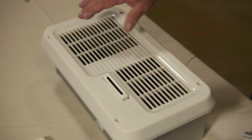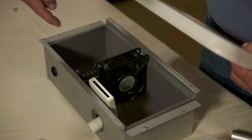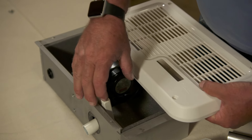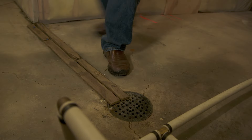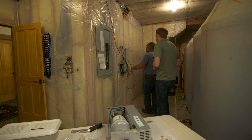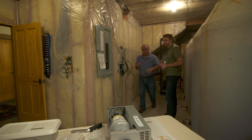The second component is this fan box. The hose sends steam in here, steam comes out here, and there's a little fan that draws air in from the room, across the steam, and back out to deliver humidity into the space. There are three connections we need to make to the steam generation unit: one is water — we've got that right here — the other is a drain — perfect right there — and electricity is right close by. So somewhere in here feels like the right location for the steam generation unit.